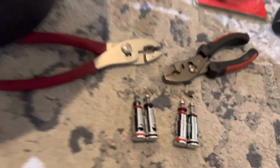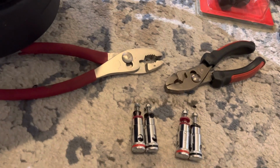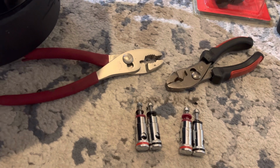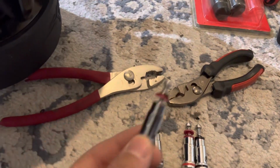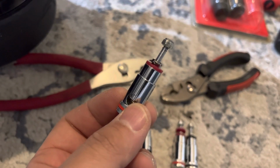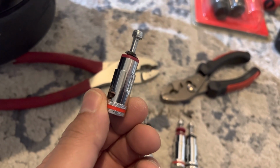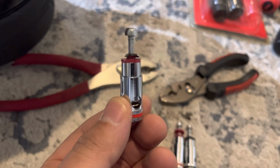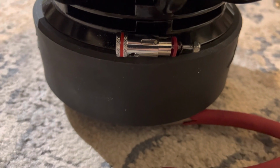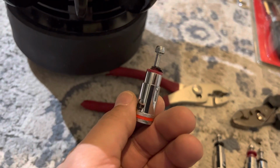We all love our oxygen-free copper as big as it can be, minimizing resistance and having copper. But you know, these are steel, right? So you're running your 8-10 gauge wire that you spent quite a bit of money on, and running it to this terminal, which is steel. It's magnetic. It's not a very good conductor, right? So it is a resistance point, but I know that gets overlooked.